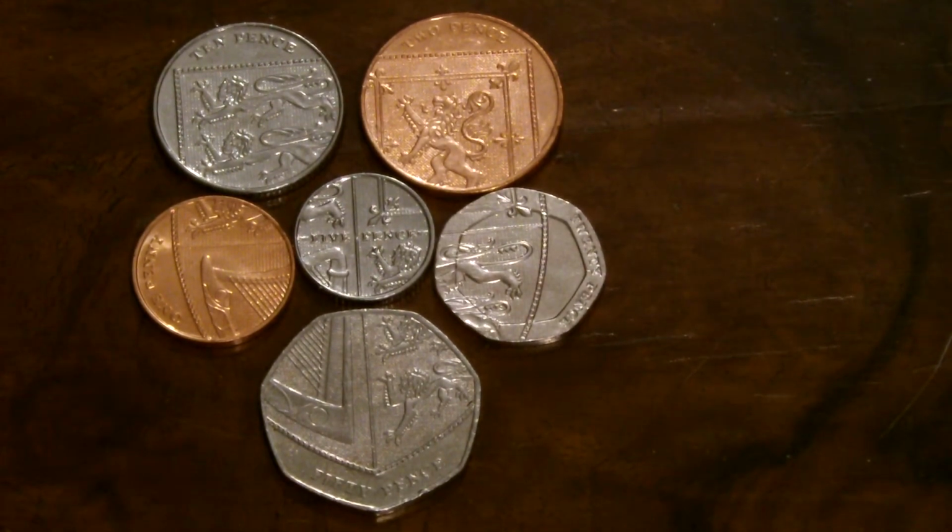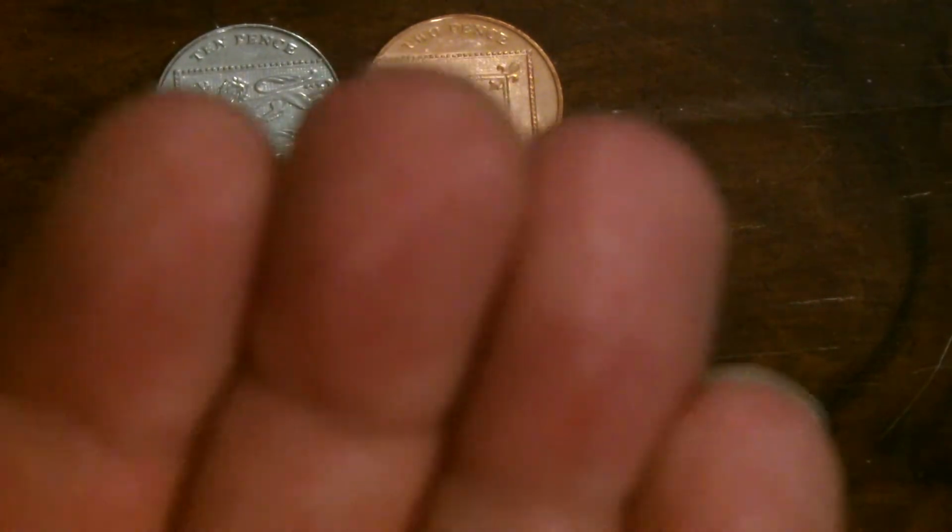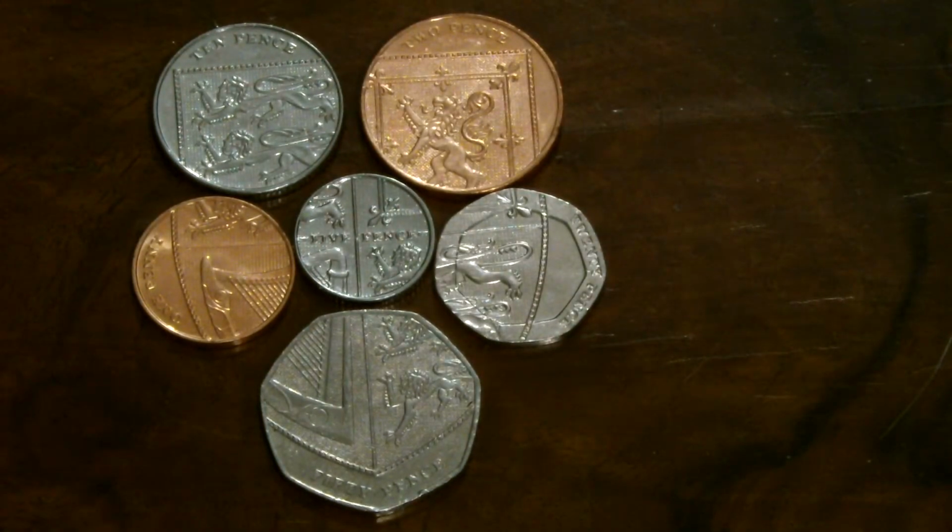And what annealing does is it takes your solid metal and allows all the atoms to jiggle about and fit into a more comfortable position. So it basically removes these internal stresses that you've built up by working it. The technical term for what this is doing is reducing the amount of Gibbs free energy in the structure. Why am I boring you with this?